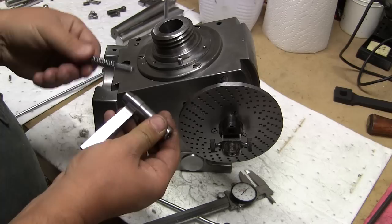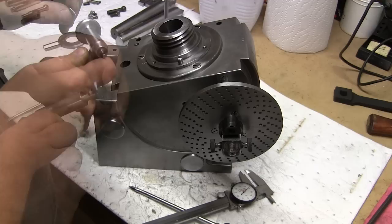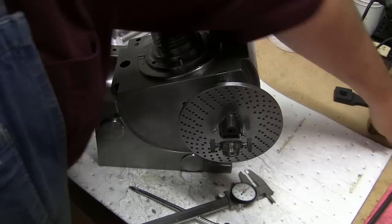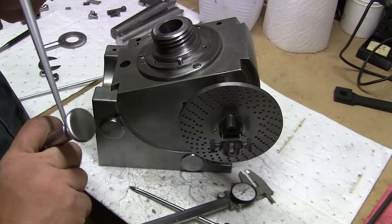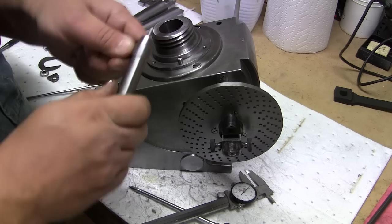Now I'm going to put together the plunger, which is made up of a couple of parts. The actual plunger with the spring goes inside, then you put the knob on it, and it's held in with a taper pin. Gotta love these taper pins. I have a punch right here — this should go right in, and it does. Thank God — taper pins are usually a royal pain. So let's put a little oil on here.